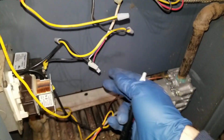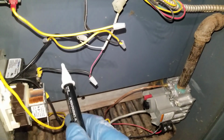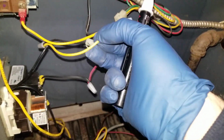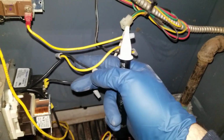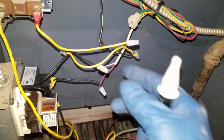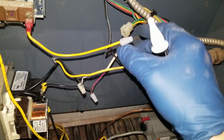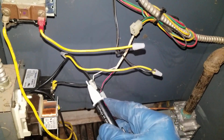There's a thermostat. One side is connected to 24 volts. So 24 volts goes to the thermostat, and then when the thermostat is on, or there is a call for heat, that 24 volt comes back. Now the reason I found this interesting, I don't have a vent damper connected anymore. This was obviously not done by us, but by someone else, but I'm gonna explain what they did, because I just followed these wires. Alright, so 24 volt comes back.